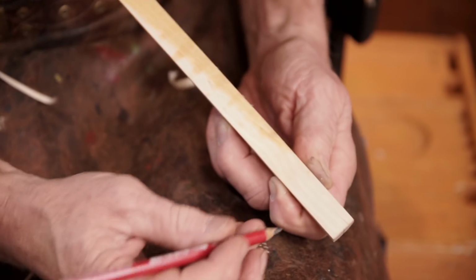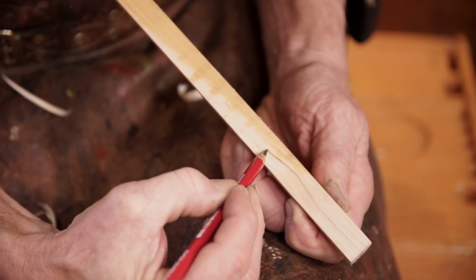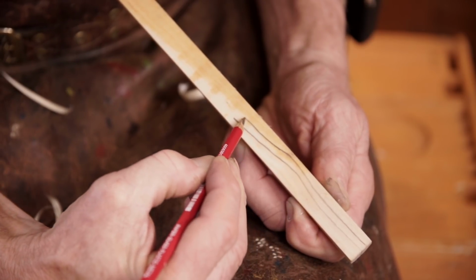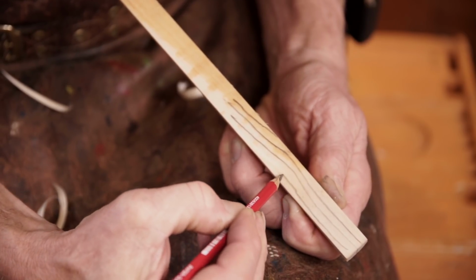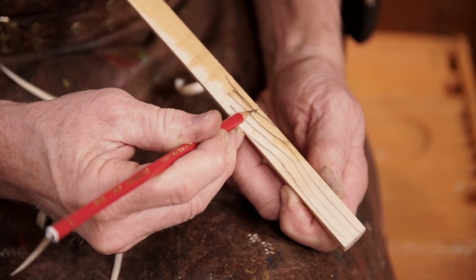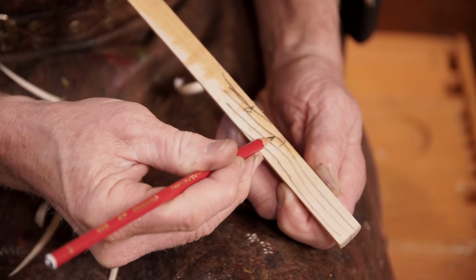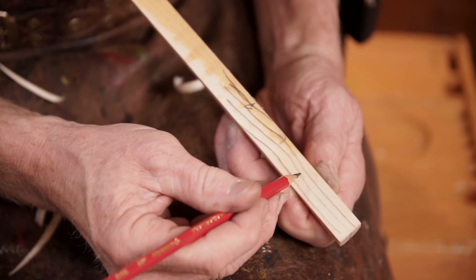And let me show you a very close up of this. If you take a close look here, you can see how the fibers are running like this here. The grain in the wood has grown like this. And this can cause some problems when we are carving. Because if I cut here in this direction, it will work. But then if I continue the cut over this little hill here, it will start to split very quickly. So I have to go the other way.